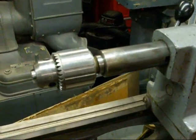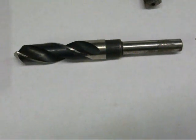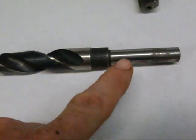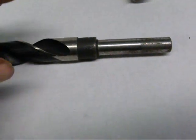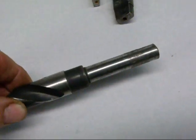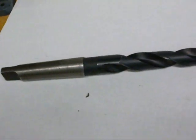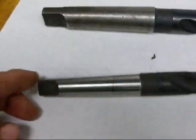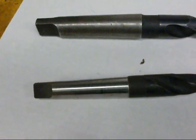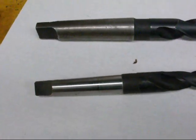Most all drill presses also employ a Morse taper. In some cases we have step-down shanks on some drill bits, but in the larger sizes they almost always slip, so they really are pretty much a failure — avoid those at all costs when using a handheld electric drill. Most larger drills come with a Morse taper. Here's about a one-inch bit with a number three Morse taper. As we get into smaller bits they have proportionately smaller tapers — this is a number two, and the real little ones would have a number one. They go up to number five or six also, but these are the most common sizes.